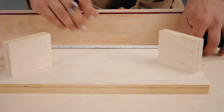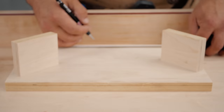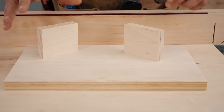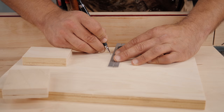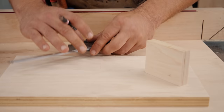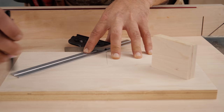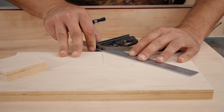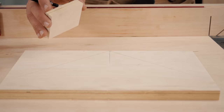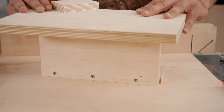So now this is our face piece, and this is what's going to screw to the side of our fence slider. I'm going to make a mark roughly in the middle — this is how we place our guides for our spline jig. It's kind of an arbitrary spot, just right in the middle somewhere. Now we're going to make our 45-degree lines off of this exact spot, so each guide needs to go right at 45 degrees. We take our square, line it right up with that line, and draw a line both ways. Then we glue and screw our pieces on. This will be a detachable face to our fence slider, so we can remove it and add different attachments.